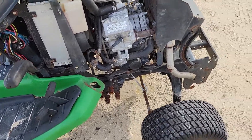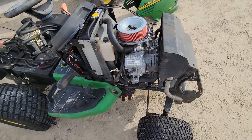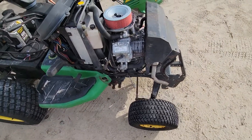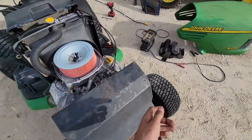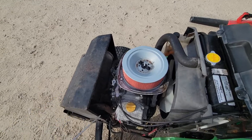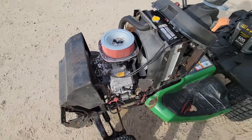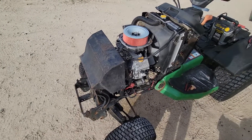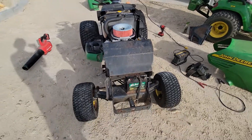I made some progress. After shutting the camera off I realized it didn't seem like it was pumping coolant like it was supposed to. I opened up the radiator cap and it was completely empty. After putting some coolant in it started spraying coolant all over the place — there's currently coolant dripping on the ground. And if you pull the dipstick out, you've got coolant on the dipstick where it's not supposed to be. So I think I'll tear the whole tractor apart to freshen it up, probably taking the engine apart too to figure out exactly where it's leaking and fix that. That's it for this video, thanks for watching.